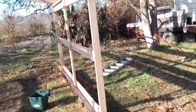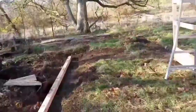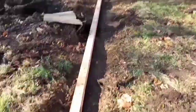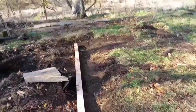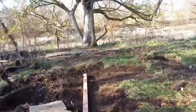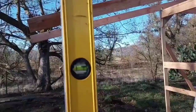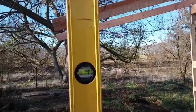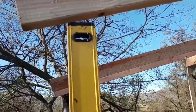I'll show you how we're determining how tall to make the overhang wall. So we leveled this skid — cedar skids — and then taking a level, getting a level bubble coming up from it, and then measuring the distance to the rafter tail.